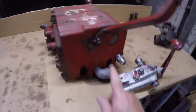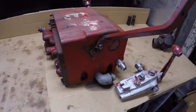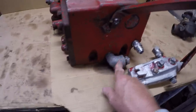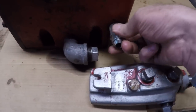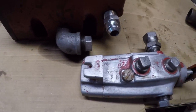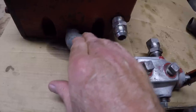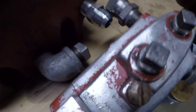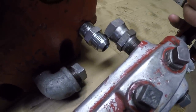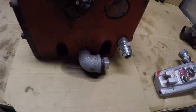One of the main reasons for that, they welded this on. This thing's been spewing oil all over. I'm assuming the seal is bad in there so we got to get that fixed. You'll notice there are a lot of galvanized fittings on this thing. I'm going to convert a lot of that stuff over to hydraulic fittings where I can clamp this auxiliary valve easily onto there. One thing you got to make sure with the auxiliary valve — you have clearance for the suction hose off the reservoir right here. From what I can see, looks like we should have plenty of clearance in there. I don't think we'll have an issue with that, just with them two fittings.